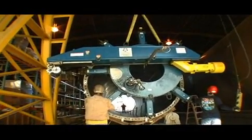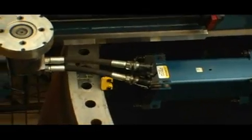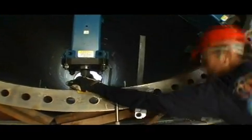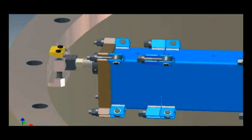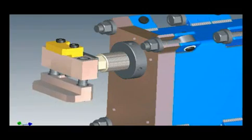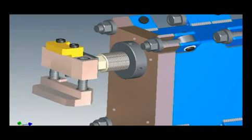It takes two people to unload the CM6000. When you load it and unload it, you have a crane operator and you have a guy holding the mill itself getting it fit into the flange. They have adjustment screws that screw out to the diameter of the flange that you need. And then as it chucks to the flange, it also has screws that adjust up and down that clamp the foot to the flange.